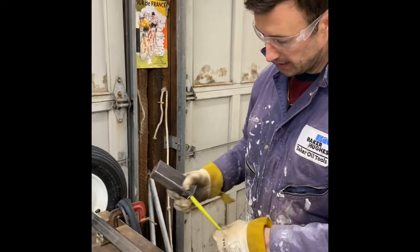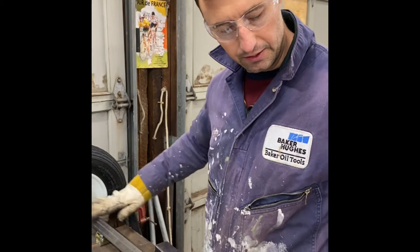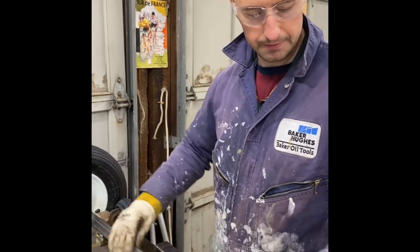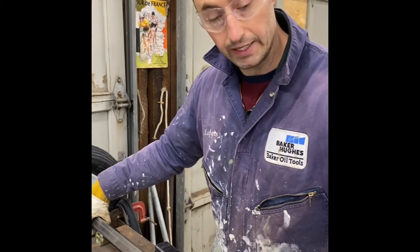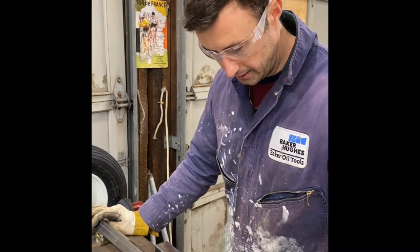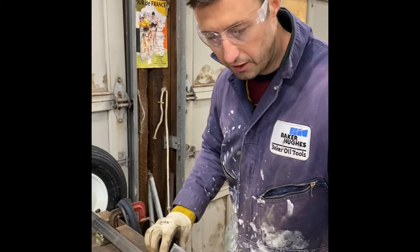So I have this sitting up, and I want my axle to be diamond side, shaped like a diamond, so the pointy surface would be up. It just helps slough off any salt water, any kind of dust, whatever, sand, and it will add to the rigidity being in that orientation. So, all right, I'm going to play with some of these angles and see if I can figure out the best route. All right, here we go.